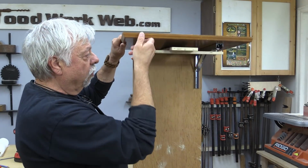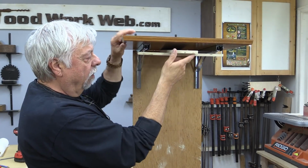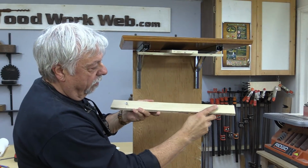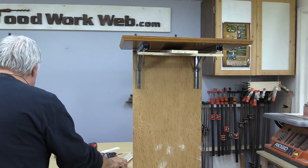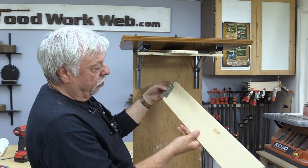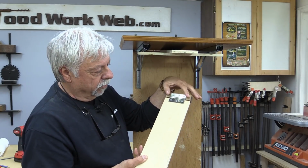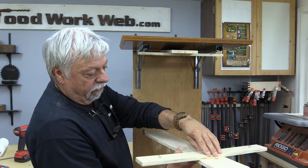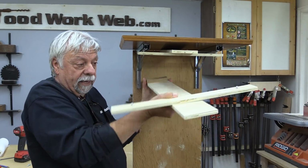that quick and easy. So what this is basically, you can see it's kind of a wooden T-bracket, and all that I have here are some screws. So this is basically all that's pushing up on the little release buttons here, and I have made up a sort of working model of this, and here's the finished one. So what I'll do is I'll countersink a couple of holes in here, drill some holes in here. That will go on the underside, and what I still have to do is to fasten this to the underside, and then this will go up like that.